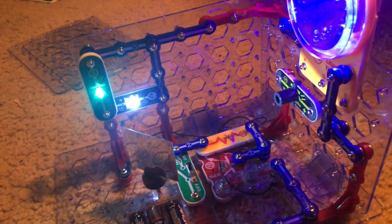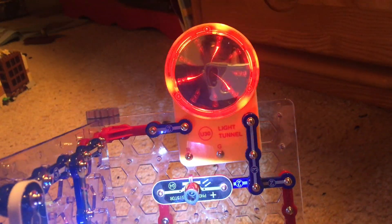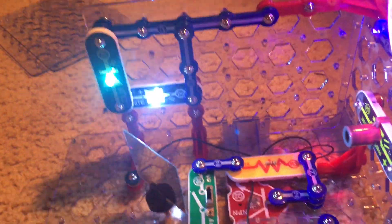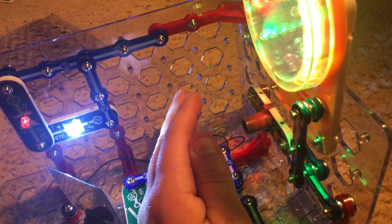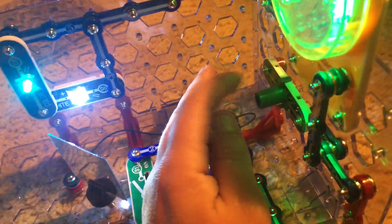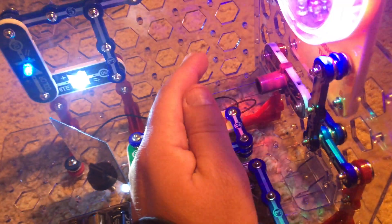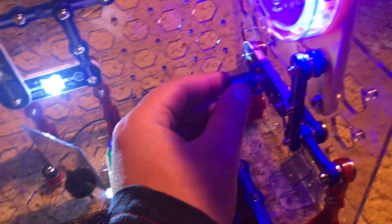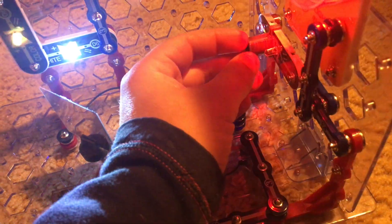When I turn on the slide switch, we have a loud horn, the color LED and tunnel lights flash, and the white LED is on. When I turn off the slide switch, the horn stops and everything stops. If I put my hand here, the horn stops even though the LEDs remain on — that's because the horn is being controlled by the phototransistor. When there's light on the phototransistor, the horn will sound; when there's not, it won't. If I remove the cover from the phototransistor, background light may activate it.